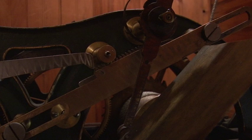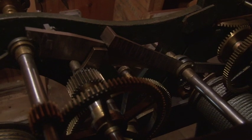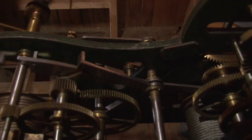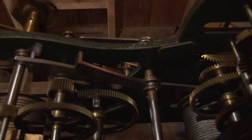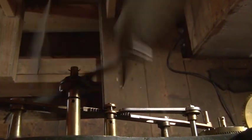The rack is now set. Each notch on the rack is one bell strike. We see 6 notches exposed. At 6 o'clock sharp, the lever drops off the cam allowing the weight to rotate the drum. The gears jump into motion, slowed down by the fan fly. A pin in a wheel that rests on the rack grabs one tooth on the rack per rotation.